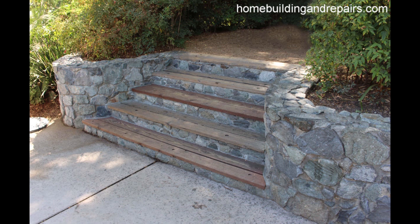The purpose of this video was to point out as a design, give you some design ideas, something to think about if you're going to design a stairway like this. To recap the three things: make sure that the bolts and nuts are not sticking up — that's a trip hazard — and make sure the holes are not too deep; you could fill them with some type of filler or plugs. The gaps allow debris to get caught in there and rot the wood faster. As a suggestion, you may want to go with concrete and use a concrete tread.